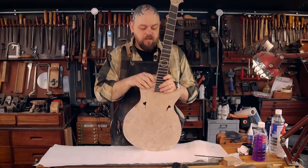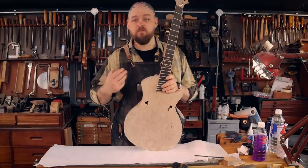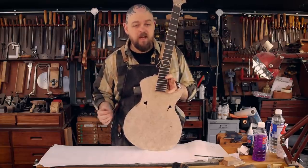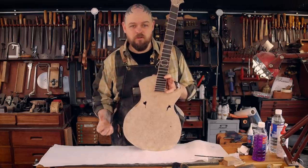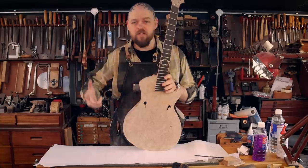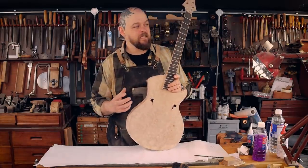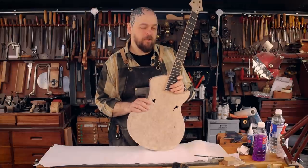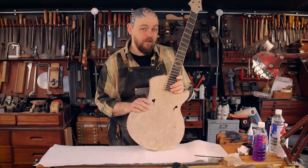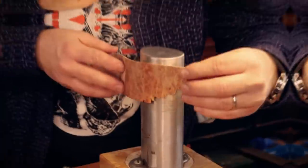The thing is though, in this one, I'm going to be applying a stain and then sanding that stain back, thus raising the grain and flattening it back. I'm then going to be applying a multitude of stains and other things as well. And all of these things are going to raise the grain and so on. The end result is going to be a flaming hot mess. Hopefully a Nebula-esque flaming hot mess. Full of stars and sunshine and beautiful things. Not a steaming hot mess. But we'll see. Anyway, here is how we got to this point.